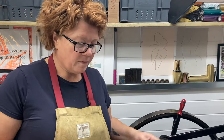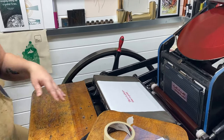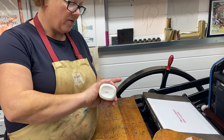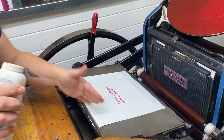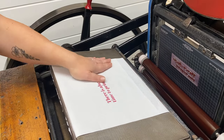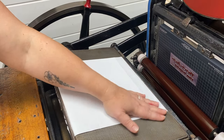Once you've printed on your tympan, bearing in mind that this ink is going to be wet, you use a small amount of French chalk — or in this press room it's Johnson & Johnson's baby powder — and we just apply a small amount to the ink to make sure it's all nice and dry and won't transfer onto the tympan sheets that we're going to be using.